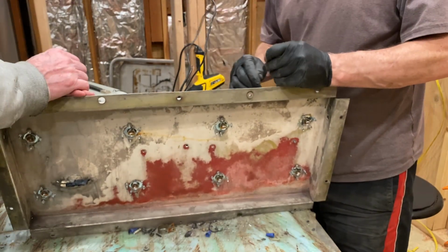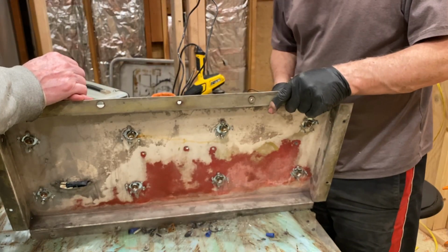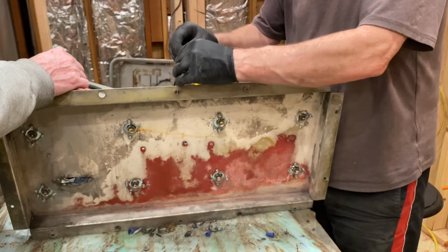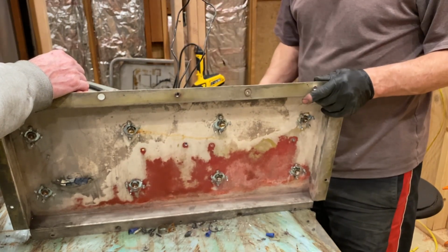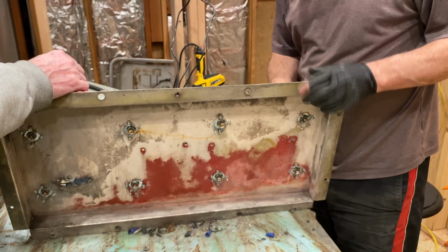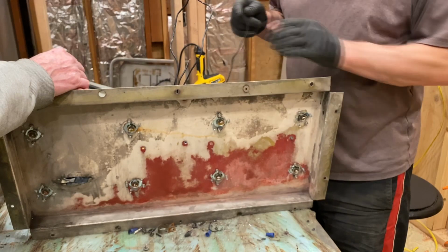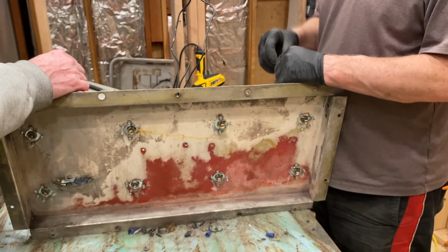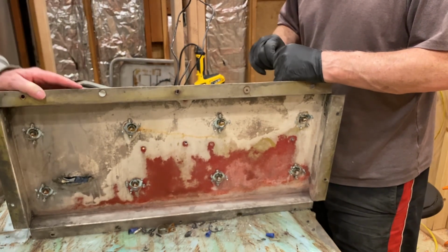So, you know what I could do? You should have just done it like. No, it's fine. I was hoping that I could just have one continuous circuit, but it's got to have an in point and an out point, or it doesn't work. You can't just go, all right, I'll just hook to that wire, because that's what I did over at that sign. I hooked in the middle of the thing. It just don't work that way.